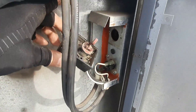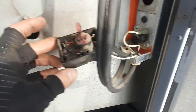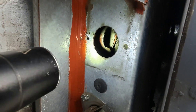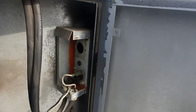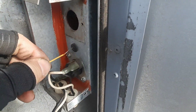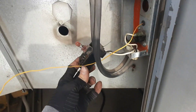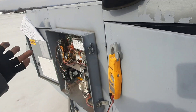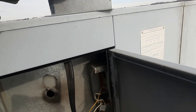Just to show you what's inside this box here — there's your TS-114, that's the temp sensor. I don't know what you call it, a sampling tube or what, but the air comes in here and then it's got another spot on the bottom where it goes out. This is your high limit, and that's why they give you this little grommet. A K-type probe — just go right in there, and that should give us an accurate reading of what our actual temp sensors read. 160 degrees or whatever you're set on — depends on the model; some of these smaller ones are 130.